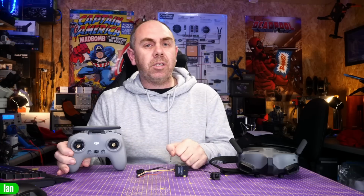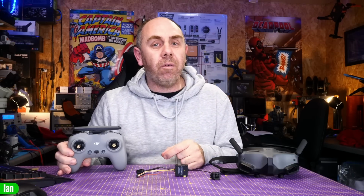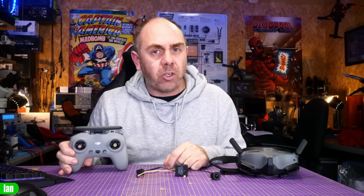The fact that the video signal loses with the remote at the same time means your aircraft is going to do whatever the default failsafe behavior is, and you're going to need to make sure that you have that set correctly and take that into account when flying, because you're going to have no ability to react when that happens. What I'm going to do next is walk you through this on the Spectrum Analyzer, just to walk you through that whole behavior, because it is rather interesting.